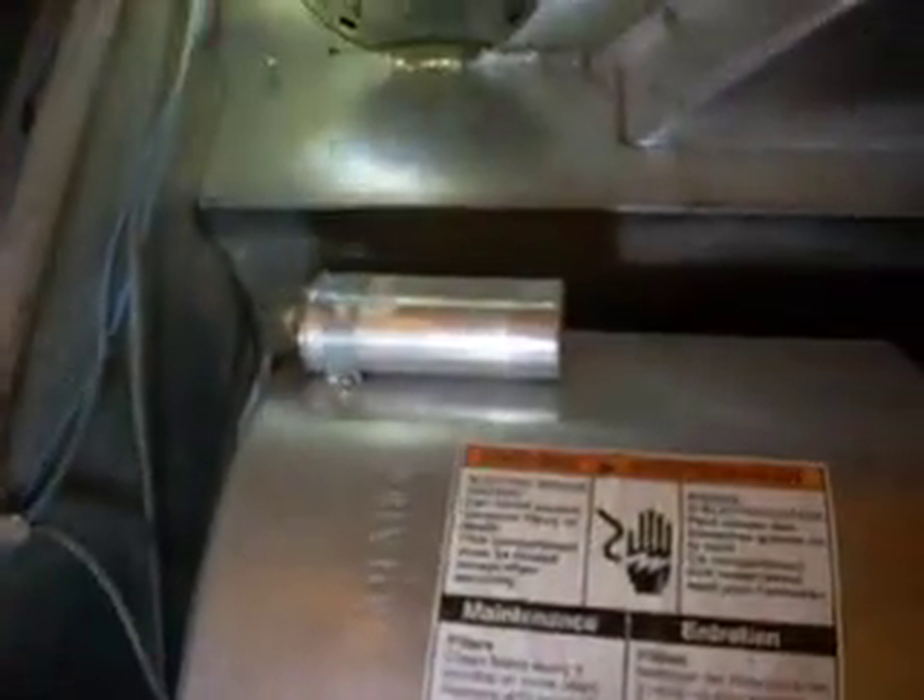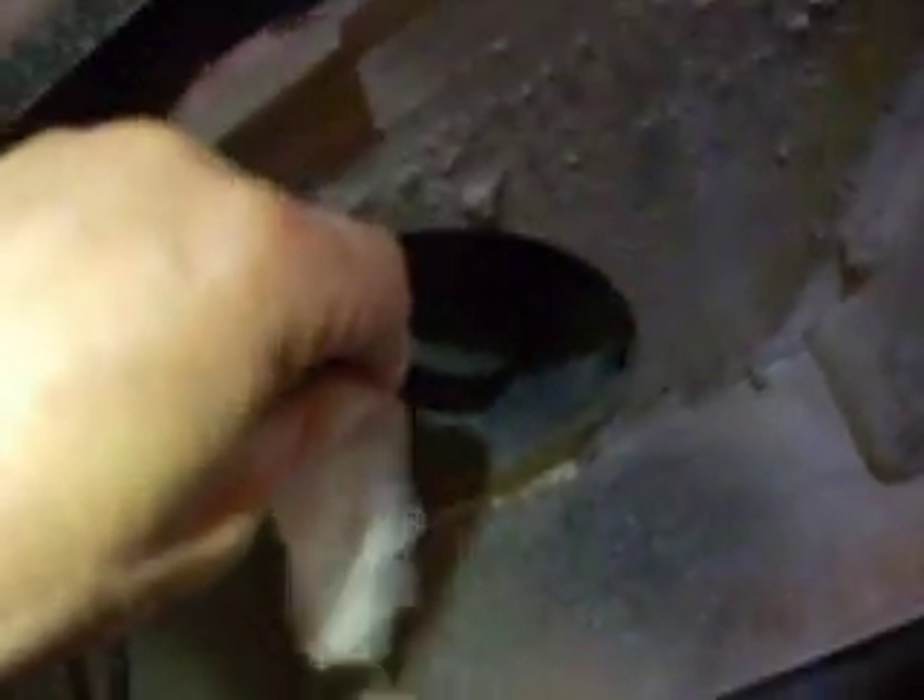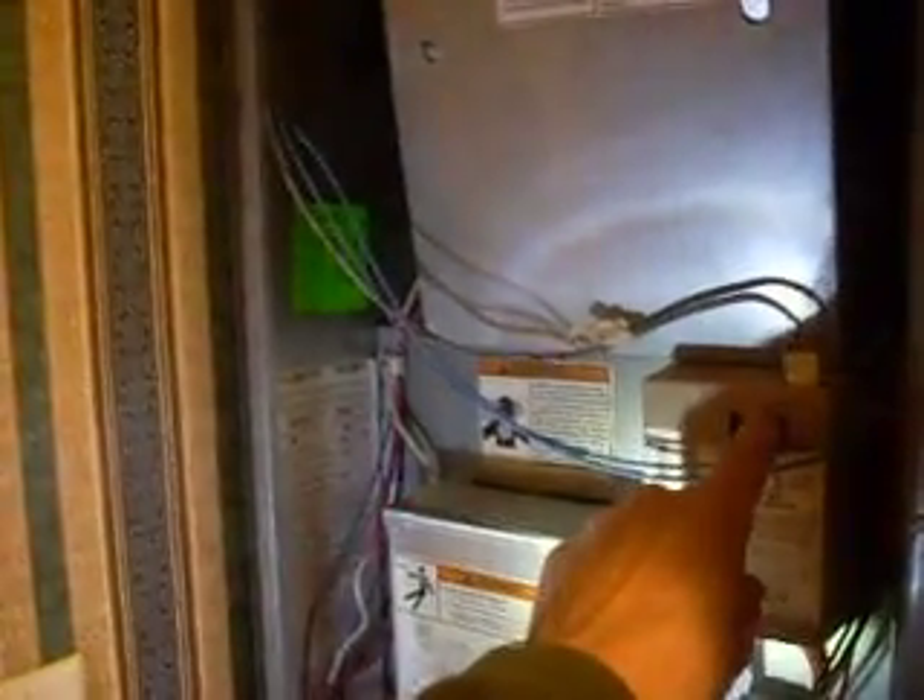You've got a piece of toilet paper — let me show that happening. By the way, this is a Coleman. I'm going to show you — in case you can feel the air moving in. See the air moving that piece of toilet paper? It's coming in from the roof. Now for some reason we probably have a butterfly sensor in that thing, and it's sending an alarm, so we'll shut that system down. You'll notice that the damper closes when you disable that blend air intake.